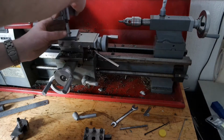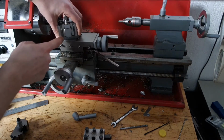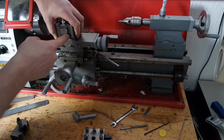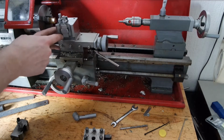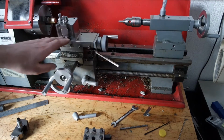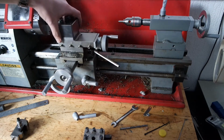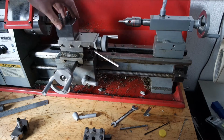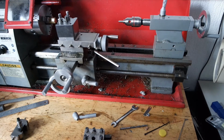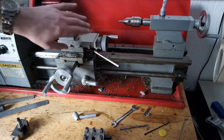Because if I fit it like this, it's too high, and some of the tool blocks have to drop below the line, below the tool block, and that's not possible at the moment. So I either have to cut some openings in here, or reduce the height, but it needs some work, and I don't want to do it yet. I want to service the machine first to reduce as much play as possible to really make this a proper part with parallel sides.